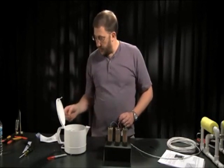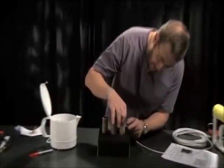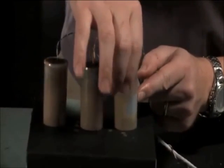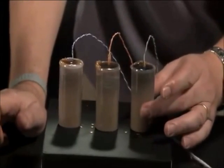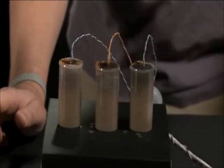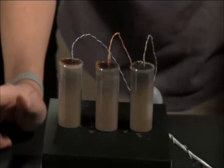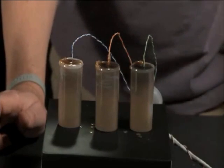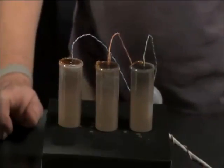One of the things that may happen as you pot your motors is you will get some air pockets, as you can see on the side of the container. What you can use is a hot air gun or a hairdryer to reheat the wax in that area, let it flow down, and then top them off again if needed. Depending on how many you're doing and how quickly, you may need to remelt the wax — hot air is a perfect way to do that.